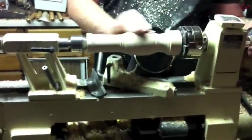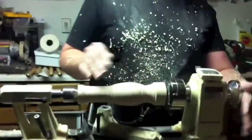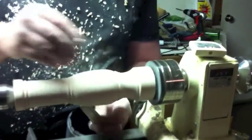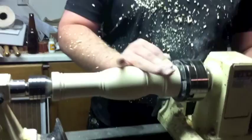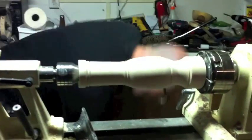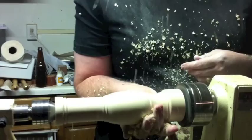I just finished up with the 150 grit. I like to always sand with the grain one time, and I just do that by hand — you don't have to do too much, it just erases some of the swirl marks that might be left behind. Get over those big beads; be careful with the details again. I'm going to do the same thing with some 220 and some 320 sandpaper, and then we'll be ready for some finishing. After finishing with the 320, one thing I like to do is grab a handful of wood chips at my feet, turn the lathe back on, and just rub those wood chips in there. It kind of burnishes the wood, makes it almost shiny with a little bit deeper look to it.